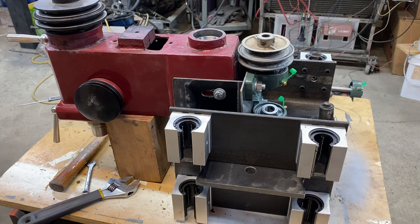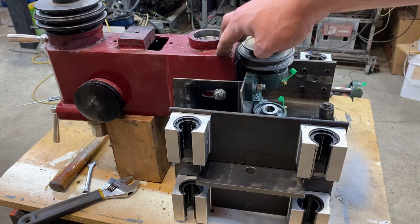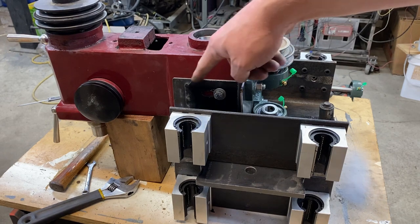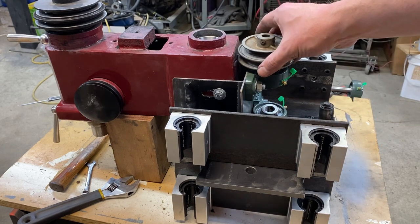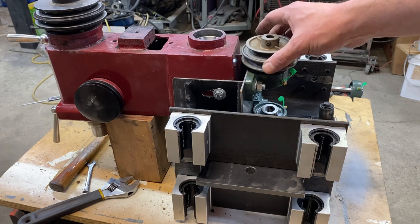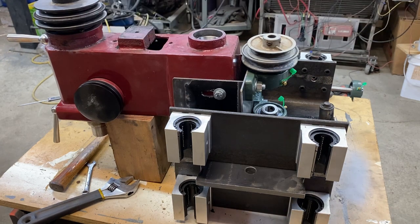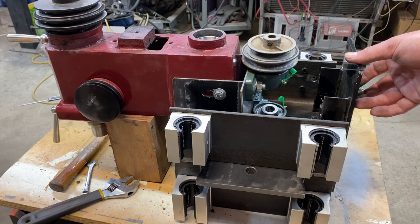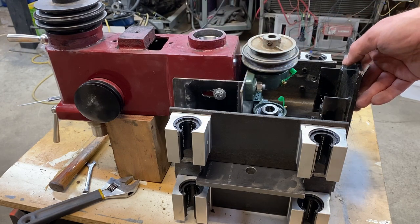This is just a rough mock-up of the entire setup and the way it will mount to the carriage. There are four holes drilled in the bottom of the carriage corresponding to four mounting holes in the mill head, so the mill head is bolted down to the carriage by those four holes. Then you have the adjustable sides welded to the pillow block plate. A shaft is going to come through the pillow blocks and into the pulleys — the bottom larger pulley goes to the motor and the top smaller pulley goes to the bottom drive pulley. The nice thing about all this is it's going to balance the machine well, with the weight of the mill head on one side and the weight of the motor sitting off the opposite side.